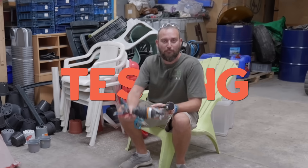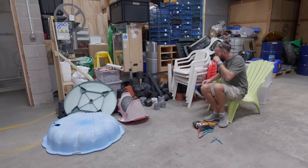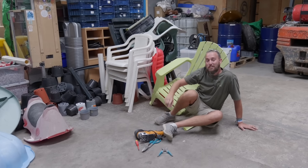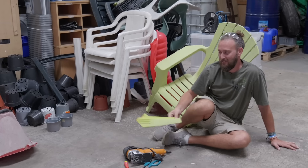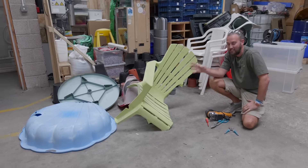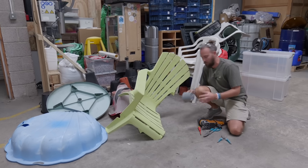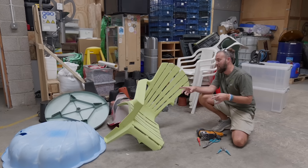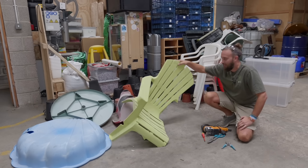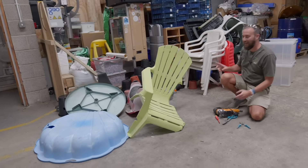It's a new day and I've dried off a little bit after all that jet washing. Essentially, what we need to do is process all this material down into usable stuff. I was going to tell you about some of the UV damaged plastic. The plan is to take the more UV damaged stuff and separate that from all the stuff that's slightly less UV damaged — maybe it's not been outside for quite so long. Like these plant pots look okay. And when we're testing, I'd be interested to see if the UV exposure has an impact on whether it turns into a new product any better or any worse. I'm going to chop the UV-damaged ones up separately, shred them separately, and test that first, then chop all these up and test them after.